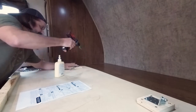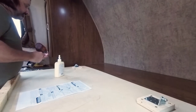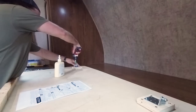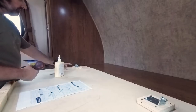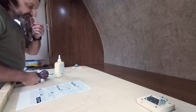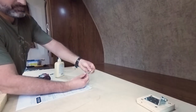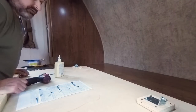There we go. We'll put the rest of these screws in — pre-drill them first. Now the two holes left closest to the nut here get left for now, because I'm going to drill those straight through. We have these long bolts to go right through to really secure it in place. So I'll do the other side.